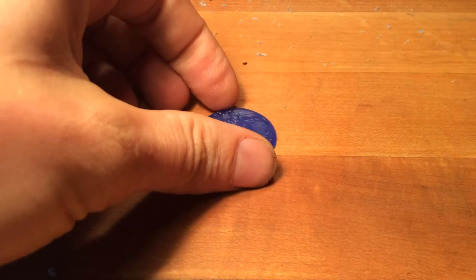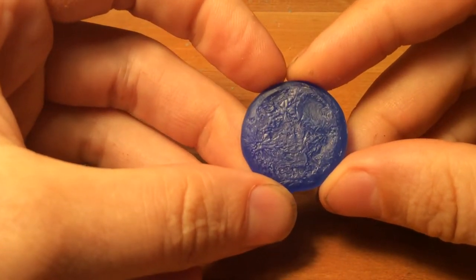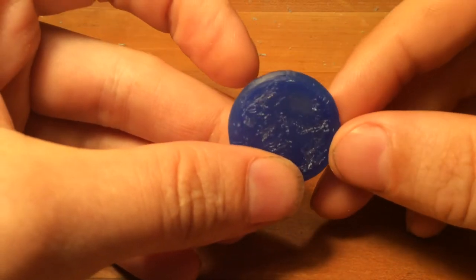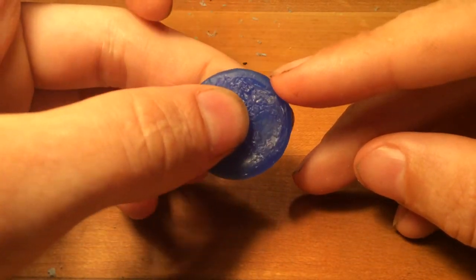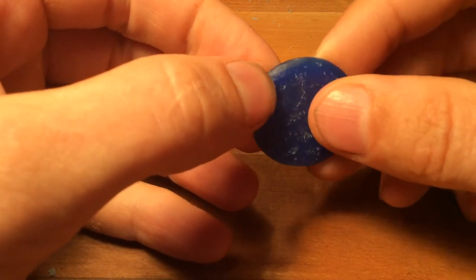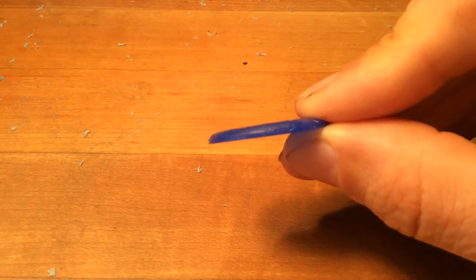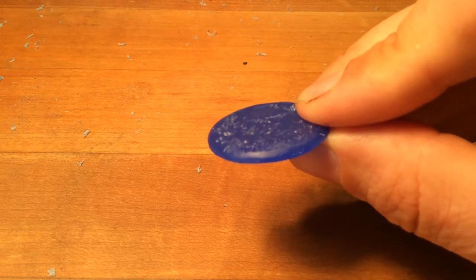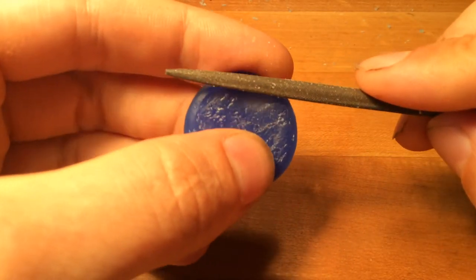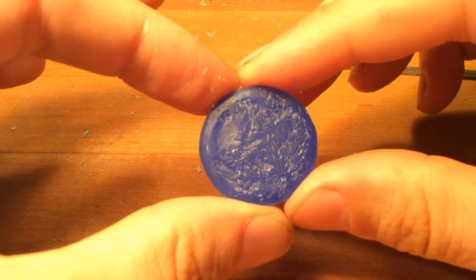The joke's on me — I thought I was recording a time-lapse when I was shaving down all the edges to this thing, and it was actually a video. Rather than try and splice it into a time-lapse, I figured I'd just explain what happened: I took a file and shaved down the edges until it was uniformly round, then spent a fair amount of time using my fingernail raking across the edge to do a nice soft radius to the edge profile of this wax. Once I got the edge profile to something I was satisfied with, I came back and did a light touch-up with my needle file. Rather than subject you to a bunch of weird time-lapse bits, we'll just call this good.